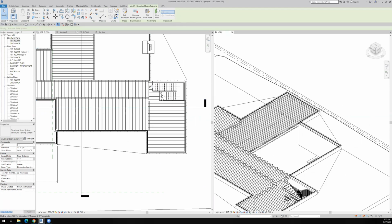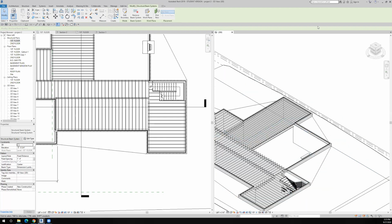One other thing that I saw was that I made the spacing here 12 inches apart, but actually I said I needed that spacing to be 12 inches apart over here. When I looked at the span of those floor joists, the distance was 22 feet. So I have to go back and change the spacing now on this back to 16 inches because that's okay. So we'll stop the video here.